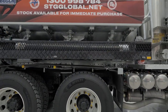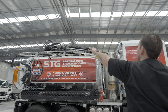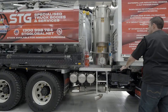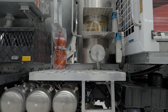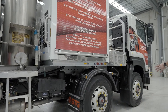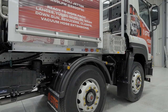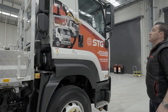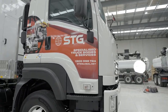Wheel nut indicators are all in place. The cage toolbox isn't overloaded and everything is secure. From this angle I'm running my eye over all the hydraulic hose fittings and elbows — no sign of any leaks, which is great. The handrail is stowed away. Going through here, the exhaust looks good, the fire extinguisher is stowed away, filters are where they should be, and there's another six-inch cam lock fitting on the bag house with the safety chain — all looking good. Checking the steer tyres, roller door and cabinet are locked away, and toolbox is all shut. Going through the wheel nut indicators on this side and making sure the mirror is as it should be.